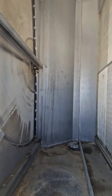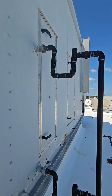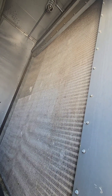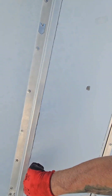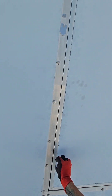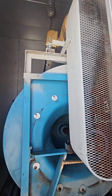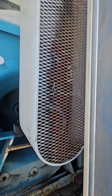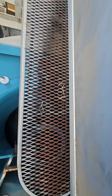The heat wheel is pretty dirty. The evap coil and reheat - it's just a hair dirty. Here's the blower - oh my goodness. These belts are sloppy loose. All the condenser fans work.